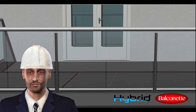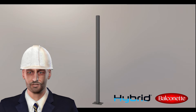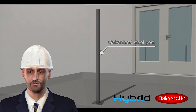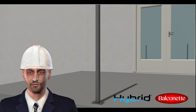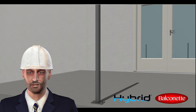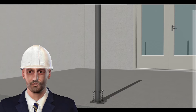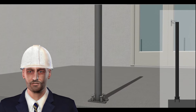The first part is known as the primary post, and the second part is known as the cover post. Steel is three times stronger than aluminum, which is why galvanized steel is the material of choice for the primary posts. This is the primary post, and it is usually installed at an early stage in the process, fixed to the structure below the finished floor level.